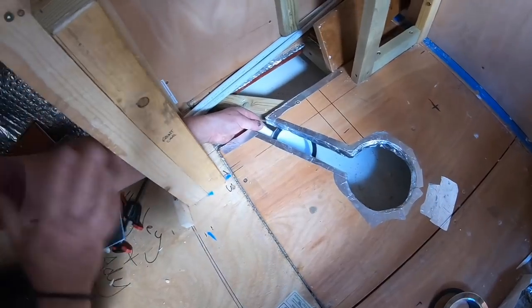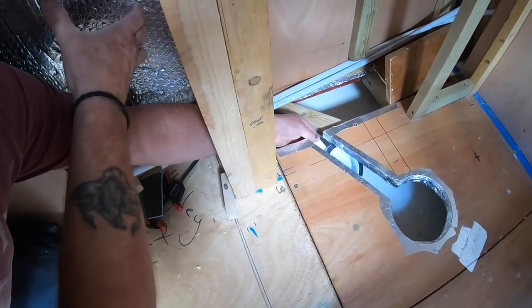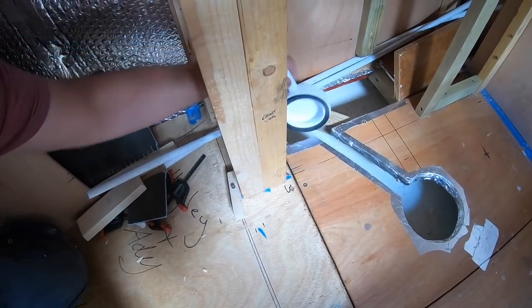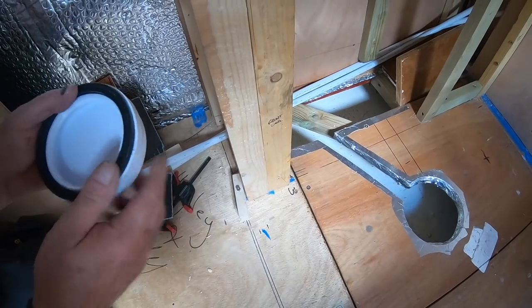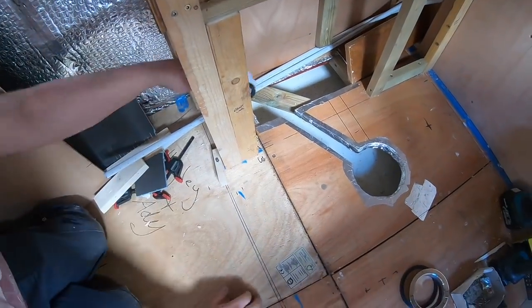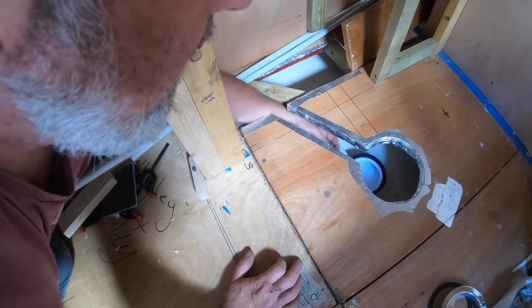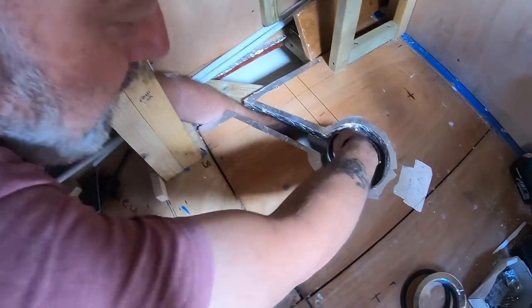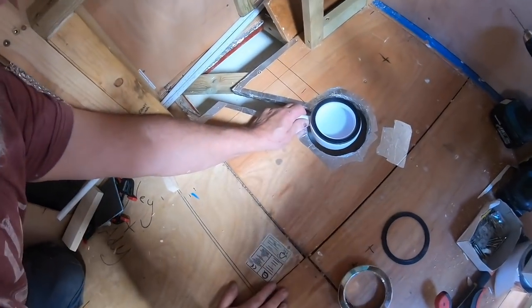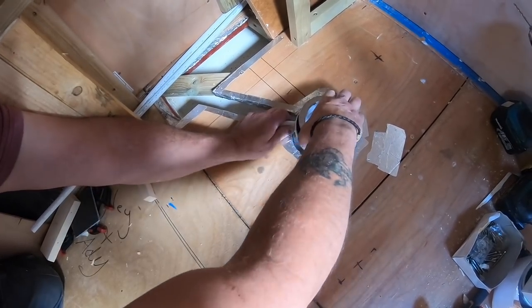And we're going to have our sink situated at the side of the shower. Inside the sink door, where the gulper is going to be positioned, I'm going to be able to get my arm in there, so I can pull that through, pull that out, and get it in my hand here. Do anything I need to do, swap it or change the hose on it, and then pass that back under there, and push on the hose so that this slides this way. And then I'll be able to reach through and pull that back up onto the shower, and then screw that down onto it. It's never easy, but it's the only way you can do it, really. And that's what we're going to do.